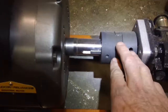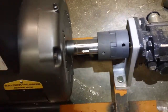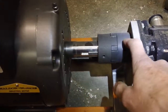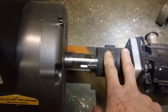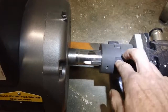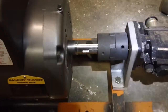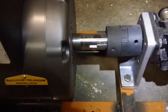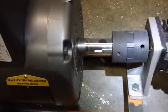I've used this spider coupler over here. This is how you put together a connection where you have a 1 and 1/8 inch shaft and you need to mate it to a half inch shaft. You buy the right sizes and there is a nylon spider gear that fits in the middle to cushion the joint, and you just screw them down with key screws.